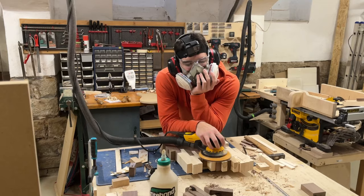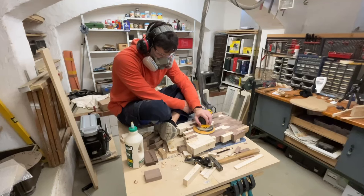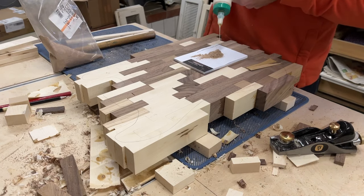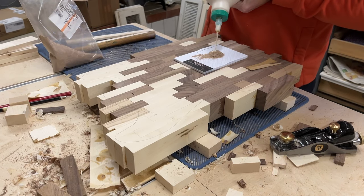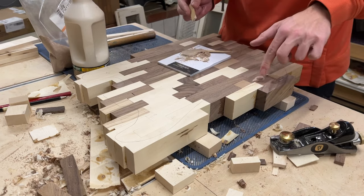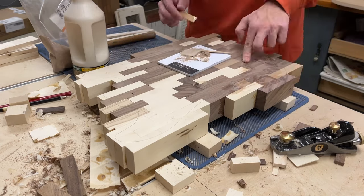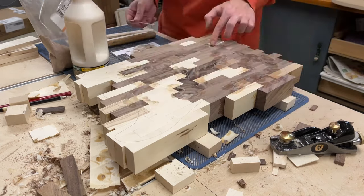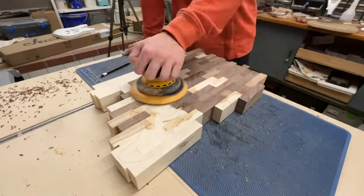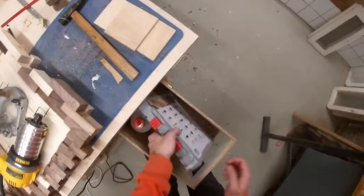And because small openings are still visible, I use the method explained earlier. Sanding shavings from the product you are working on are the best suited for this because they match the color best. The shavings are also smaller than sawdust, which makes them easier to work with. I rub all edges over a large area, regardless of whether I can see any gaps or not, to get the best result.